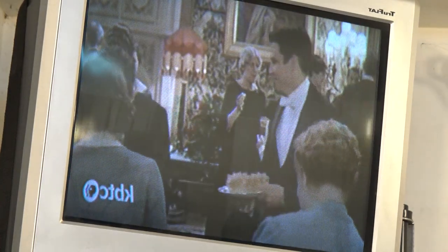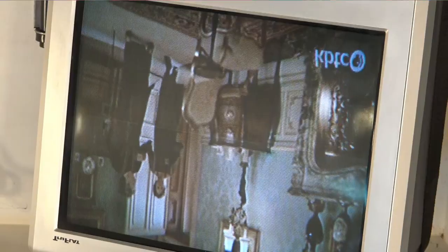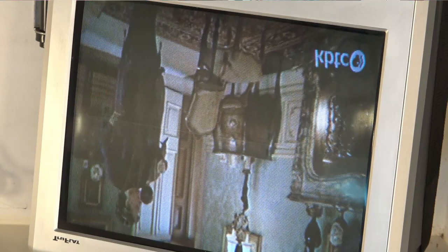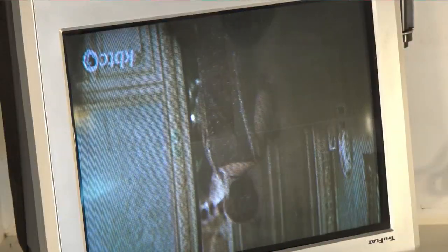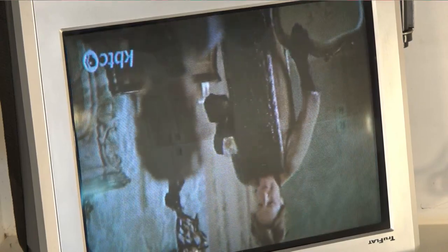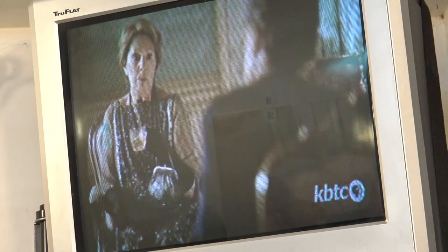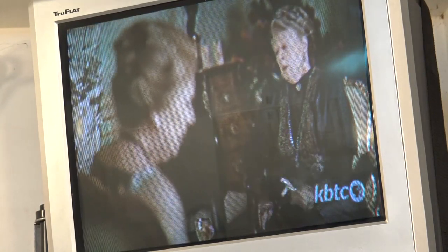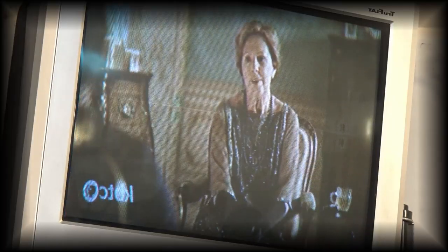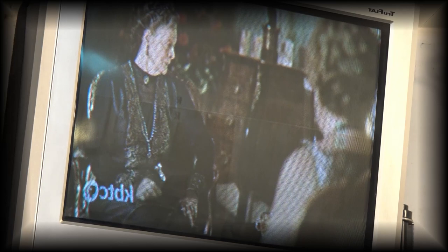And I don't get that on my regular TV because my televisions all are on an antenna facing north to pull in the Vancouver stations. This one's on an antenna, but it's just an omnidirectional antenna on the other side of the house. No reflector or anything, so this kind of picks up signals from every direction. But the other box didn't see these channels, and this one does. So two identical boxes, and one, the tuner is much more sensitive than the other.